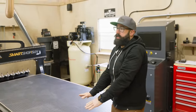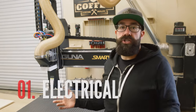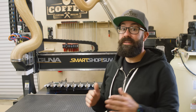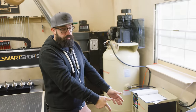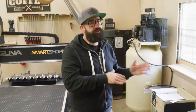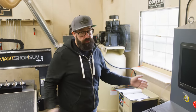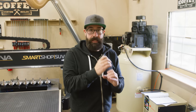Now let's talk about the costs of this new machine. This is a much more expensive machine, and it has very similar hidden costs, but they're just more expensive. First, let's talk about electrical. This is just a bigger machine and it needs more electricity. The electrical costs are higher — not talking about the power bill, I'm talking about the electrical wires. This is a 12 horsepower spindle, and it also has a nine horsepower vacuum pump. They're both three-phase machines. The power coming into my shop is only single phase, so they had to wire it to run single phase and convert to three phase for both powerhouses. That means I have to have very low gauge, thick wire. I ran an 80 amp circuit, with eight gauge wire going to the control unit and two gauge or zero gauge wire to the vacuum pump. It's really heavy stuff, and it's just very expensive.